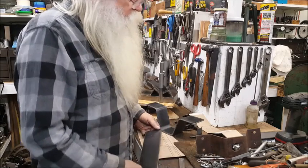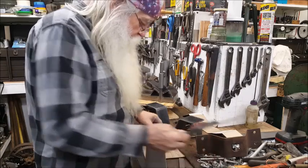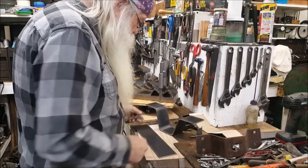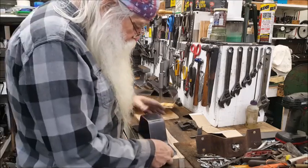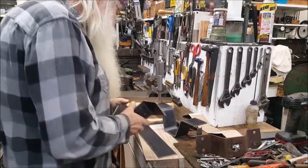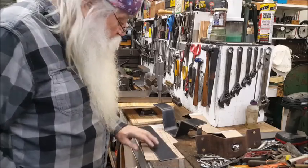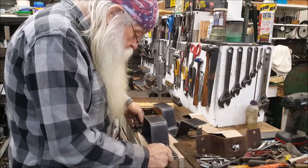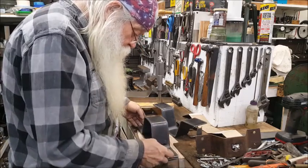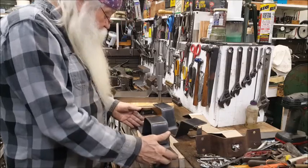Those skids I'm working with, total dimensions crossways yonder will be 1 foot. You know, let's check it out exactly. So I just cut a piece of material there at 1 foot, so that way I can use that as a test jig. Well, after it's all said and done, that's a 1 foot long piece of stock right there, cut to dimension, square and everything. And that's going to be the size, the pattern for this drill pattern. 2 bolts here, 2 bolts here, and 1 in the middle, the pivot. So it's exactly to size.